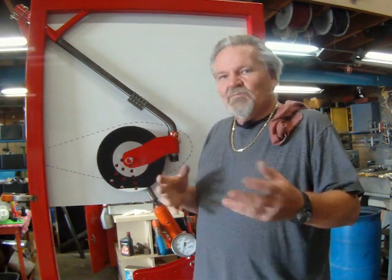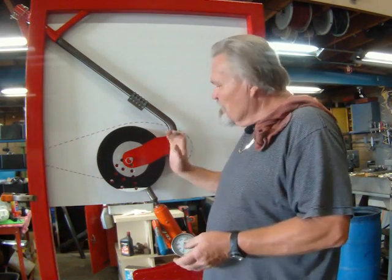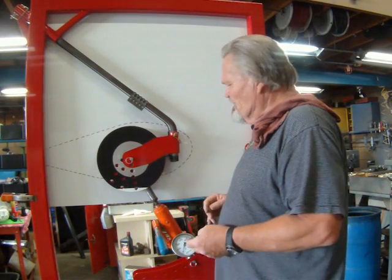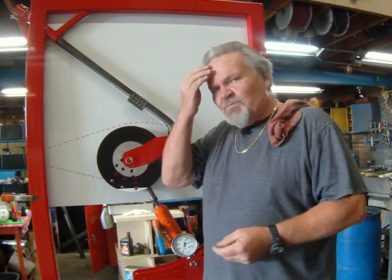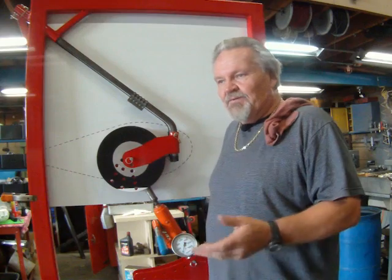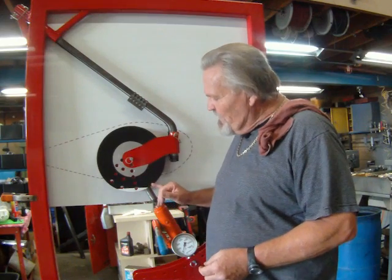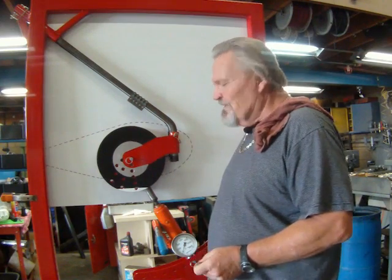If you remember a moment ago with the brace on, we were able to put 1,500 pounds onto this at this landing angle or contact patch angle, and with not an over amount of deflection. And 1,500 pounds is a considerable amount. If you were to hit something, it isn't. 1,500 pounds would be easily achievable if you were to hit, you know, a gopher hole or impression in the ground that brought this contact point up at all. It would be relatively easy to get 1,500 pounds of force on a gear leg.